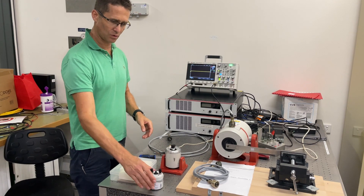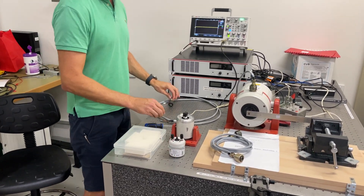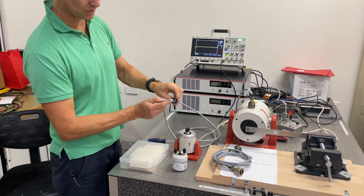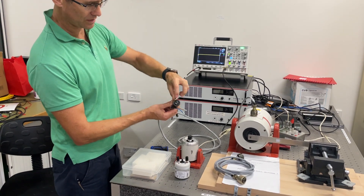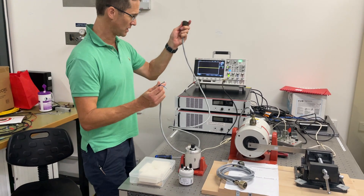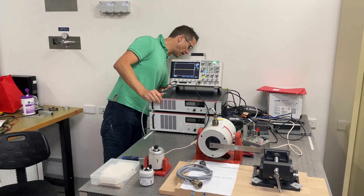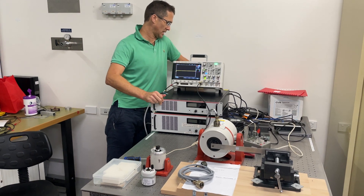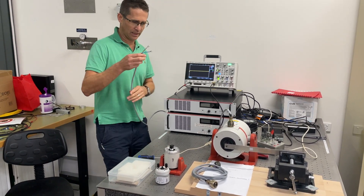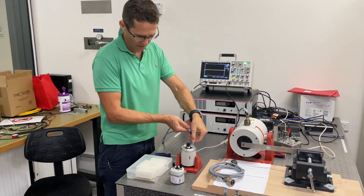For these two small shakers, you can see they've got screw connectors on the front, and we use this cable — there are a couple of these cables. For the LPA100, the differentiator between the 100 and the 600 is that it's just a two-pin connection. Going around the back, it's relatively easy — it can only go in one way, it's key-mounted, and we connect it. Then this end connects into either one or the other of the shakers.